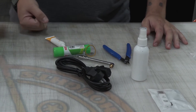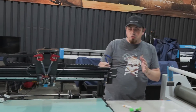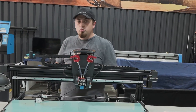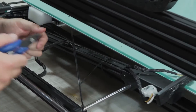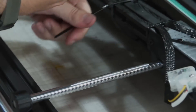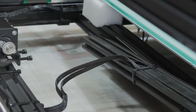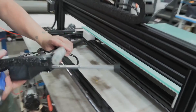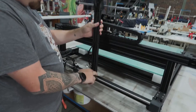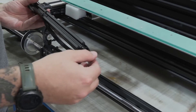That covers the toolkit and accessories. The first thing we're going to need is our cutters, to cut off any cable ties restricting the machine as well as the part at the back that holds up our plastic. Starting from the back and moving forward, we'll take out the plastic holder by cutting the cable ties holding it together — just three of them — being careful not to cut any actual wires. Now we need to attach this to the actual frame, which is just two bolts at the bottom. Unscrew those by hand and then use an allen key to do the rest.